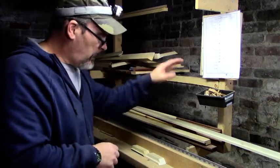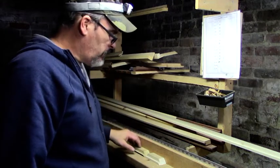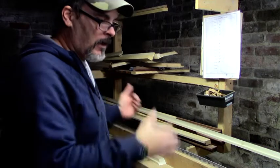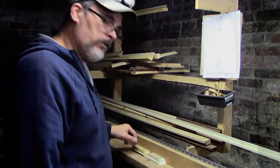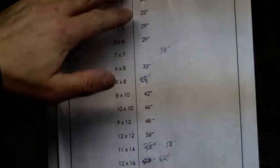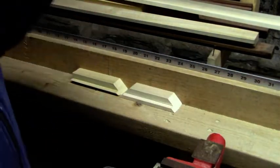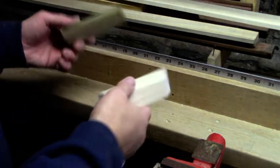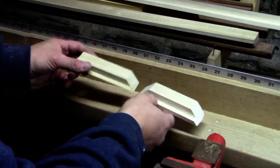If I have a very long piece of wood that's cumbersome to flip around, I'll cut sections of it that allow me to cut certain size frames. I've created a chart for common sizes — for a 5x5 it requires 25 inches of molding because you have waste. I figured it out using the technique I'll show you now. Let's say I'm making an 8x10: I have two short pieces of scraps that'll explain the process.